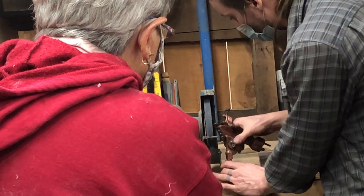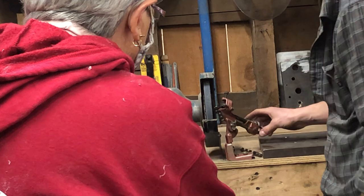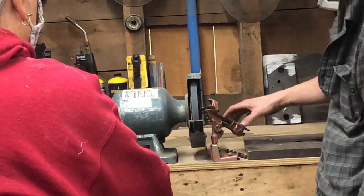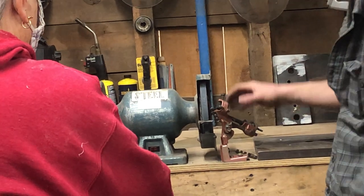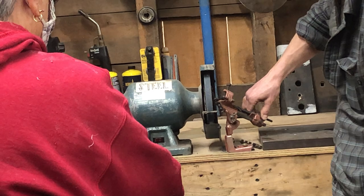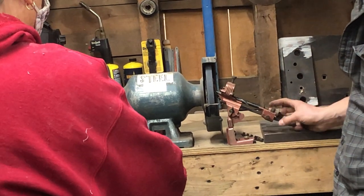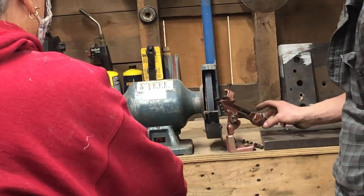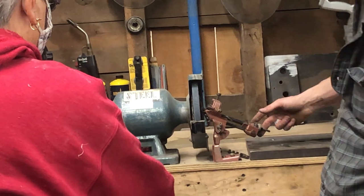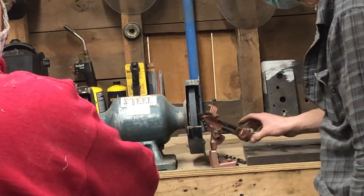Move past the grinder and just catch on the wheel a little bit, like that. And where I'm going to be pivoting this, because it's on plywood and not lagged down, it's not great. So if I'm pressing here, I can alter that angle quite a bit. So I want to run it with just my finger pressure from the back of the jig. I'm just putting my finger on the back of the jig and rotating it past the wheel. And it's not any up or down pressure, it's just side to side.